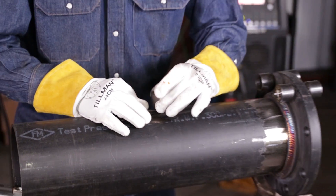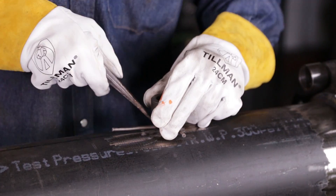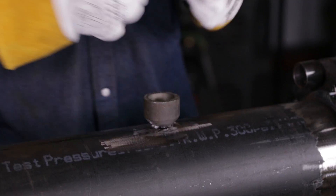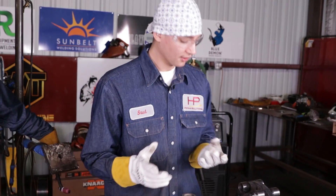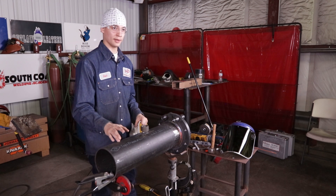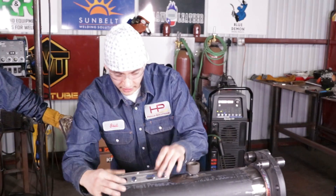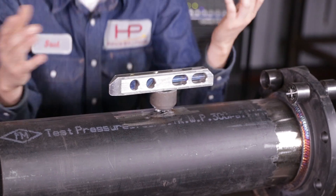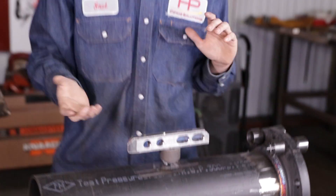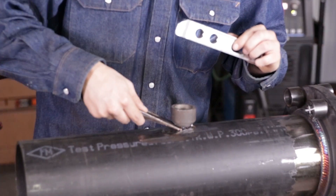Now that we have a tack — just pick it up a little bit, and if it doesn't come out right away, fitters, you've got to have wedges — just wedge it up a little bit. Should come out like that. Now since we tacked the sides first, there's two ways you can check it. Remember I told you to make sure the pipe is level — it's going to help you out in the long run? This is the reason why. You can grab your level and make sure it's level again — double, triple check — lay it on there. Every time you tack something, it's going to pull. What I like to do is leave it a 16th out, because when you tack it, it's going to be right perfect. When you use the level, it's not leveled right now, so grab your wedge and move it.